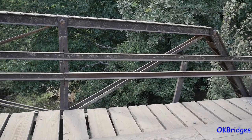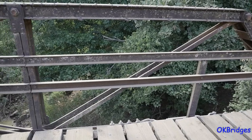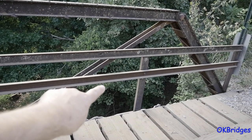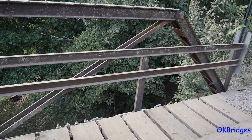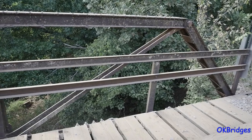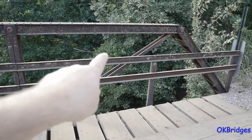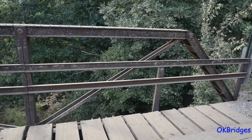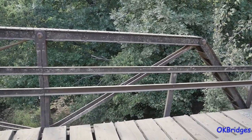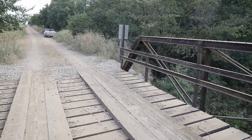Some bridges will have a strut called a Collinson strut — you often see them on railroad bridges — where the end post will have a small strut coming up that intersects it near its midpoint to help brace it and keep it from buckling. That's the problem you have to deal with with compression members: the possibility that they might buckle. So by doing this, the length of these two parts is greatly reduced from what it would be if this were just the end post. Anyway, that's my theory on it. As always, this is Oklahoma Bridges and thanks for watching.